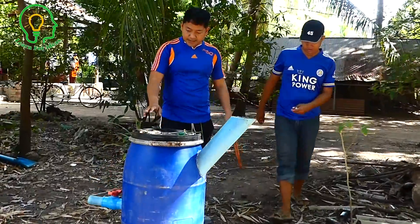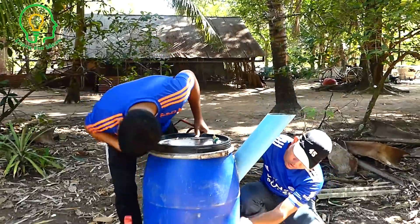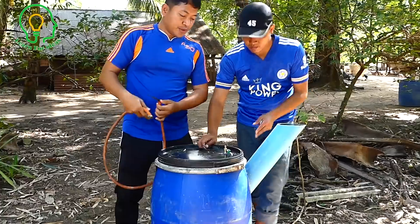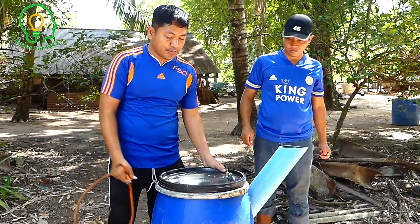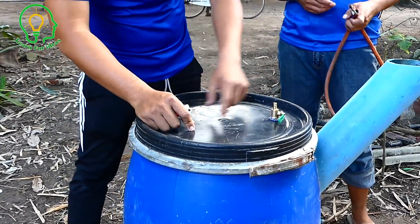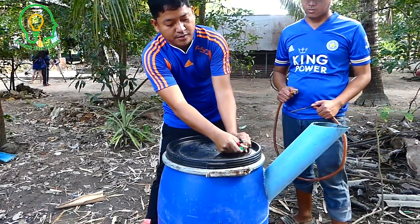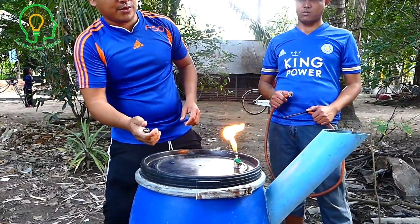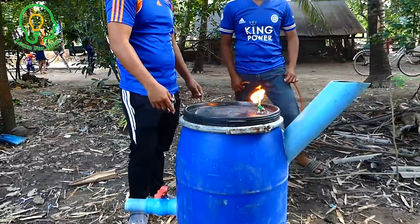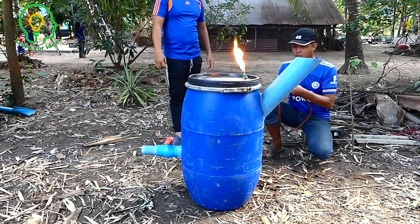It is 14 days already — there is a lot of leaf growth here. We try to burn the gas generated from the cow dung. This is already 14 days and we will try the gas inside. Before connecting to the stove we check if there is available gas by opening it slightly — it really does generate gas from cow dung, unbelievable!